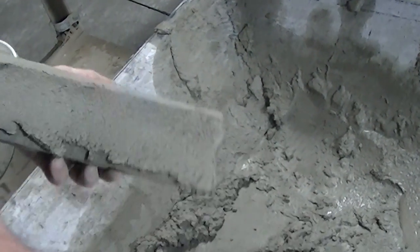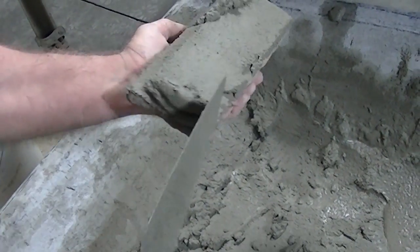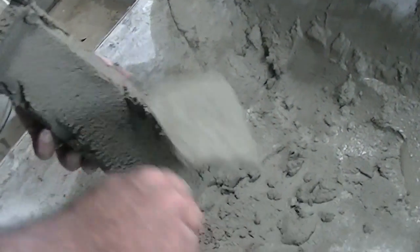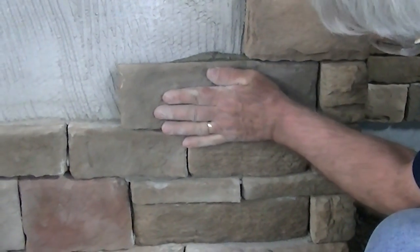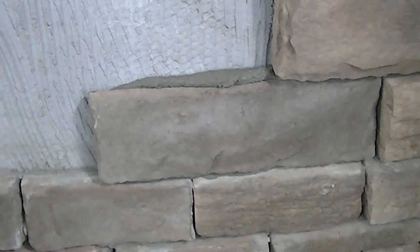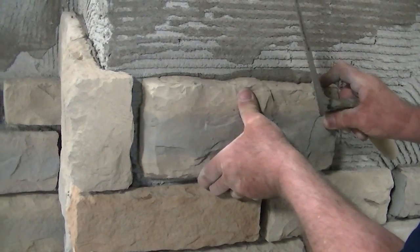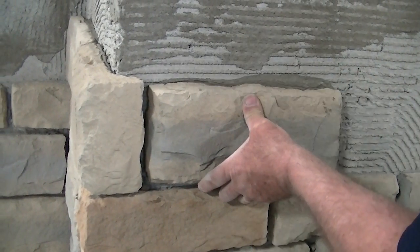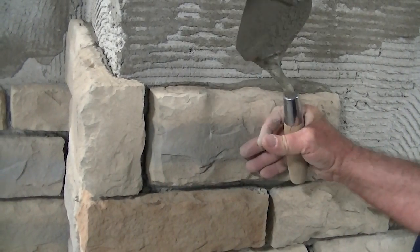Mortar may be applied to the entire back of each stone individually, directly to the installation surface, or a combination of the two. Cover 5 square feet of surface area at a time with an even coat of mortar that's 5/8 to 3/4 inch thick. We recommend that mortar be applied directly to the stones and then adhered to the scratch coat. Apply mortar and push the stone with a little wiggling action onto the scratch coat. Use enough pressure to squeeze a small amount of mortar out.